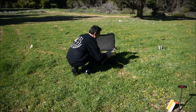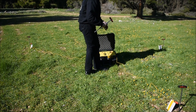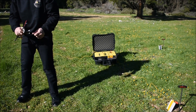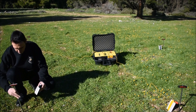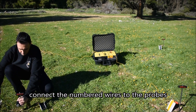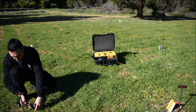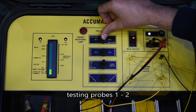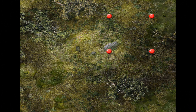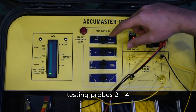Make several probe squares not only to the suspected spot but to the surrounding area also, to test ground readings for this soil and determine the average resistivity value for your ground. Each test switch scans the area between a set of probes. Total six pairs of probes can be scanned by holding their corresponding test switch for about a second.